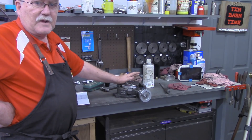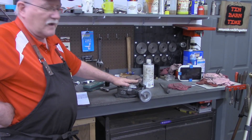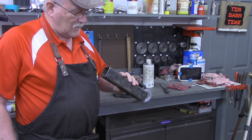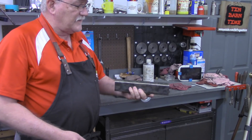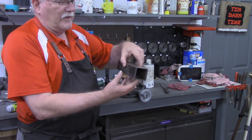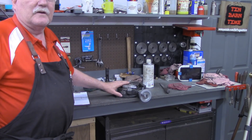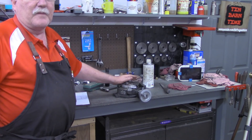My mill table is not big enough to hold the vise and the rotary table at the same time. So what I'm going to do today is simply take this piece of two inch by two inch square tubing, and make a base for this, use this as a base to mount the rotary table on, and then mount this in the vise. This is for those little quick five-minute, ten-minute jobs that the rotary table would be ideal for, but it's not really worth taking the time of removing the mill vise and having to put it back on later.